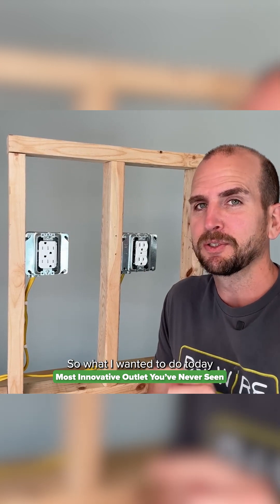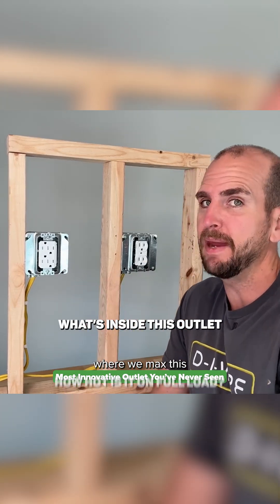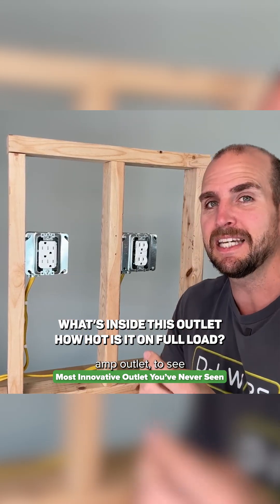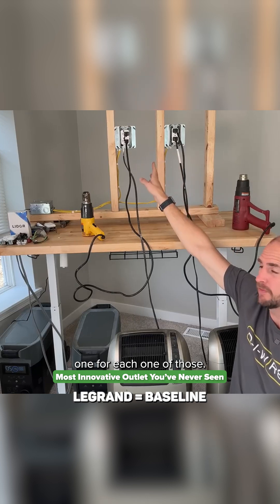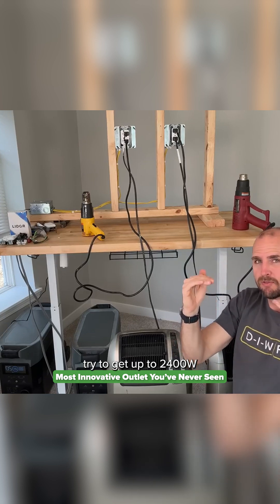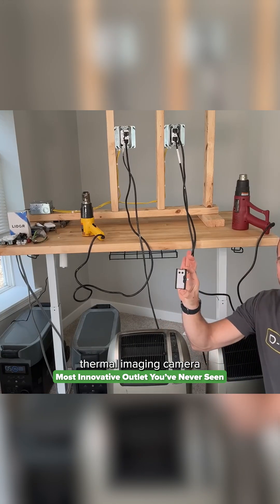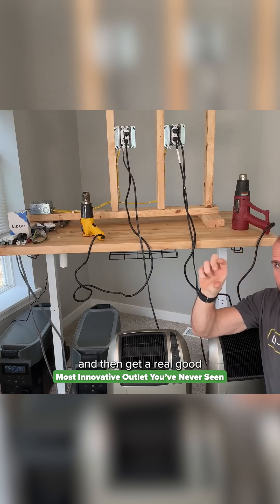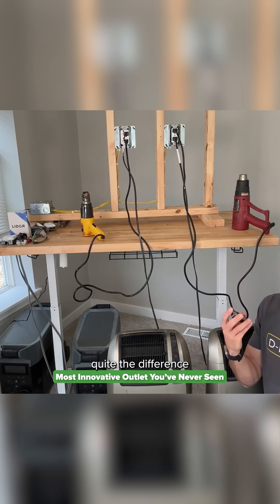I was a little skeptical, so today I want to cut open this outlet to see what's inside, and run a duration test maxing it up to 20 amps — which it should handle even as a 15-amp outlet — to see if it heats up. I'll use two space heaters and heat guns to modulate wattage, targeting 2400–2500 watts for about an hour. Every 15 minutes I'll use a FLIR thermal imaging camera on my iPhone, popping off the back of the metal junction box to see how much the outlets are warming up.